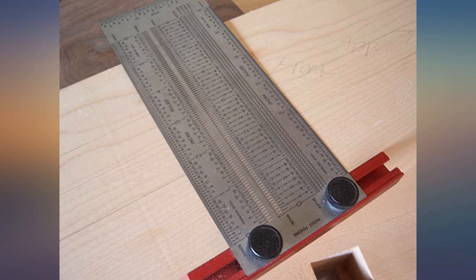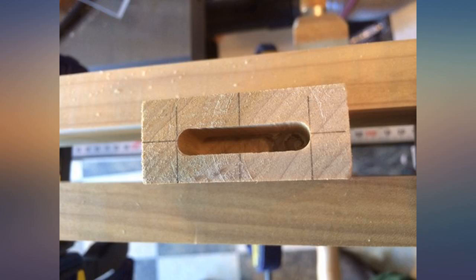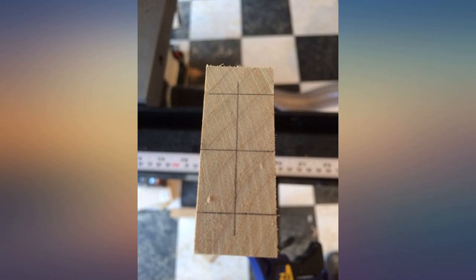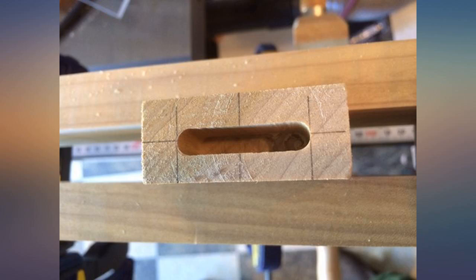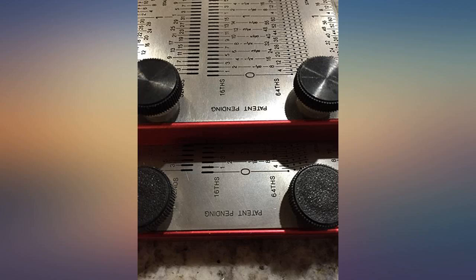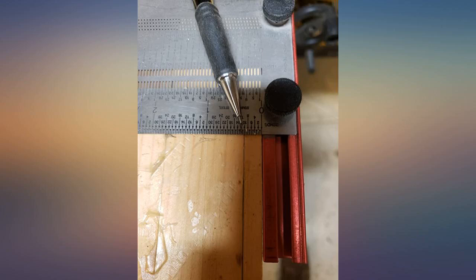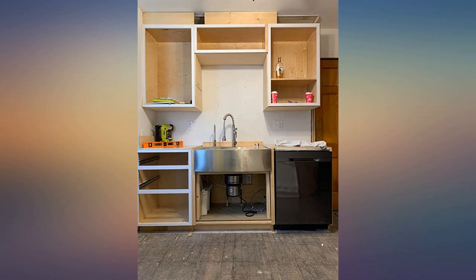I use it often in my garage woodworking projects. It makes getting accurate layouts and cuts so much faster and easier than using a tape measure. I have read reviews complaining it is too flimsy and won't last in a shop environment, but some tools require more care than others. I store this in a drawer and have not had any issues. I recently built a project requiring accurate mortises in the ends of 3/4 by 2-inch stock. The T-Rule knocked them out in about 30 seconds.